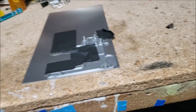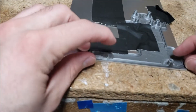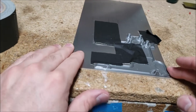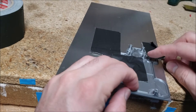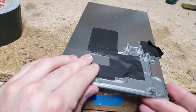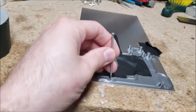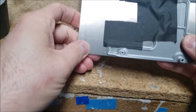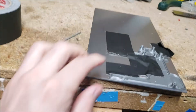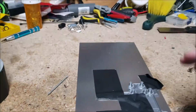Now that we've got that, I'm just going to want to make a little drill guide here. We're just going to drill one of these holes first, and then we can put a bolt through there, and that should keep us pretty steady. Then we'll work on this one. I'm just doing some double checking here. Looks good. This is just a nail — I don't have a drill set, or whatever the heck it's called. Just makes a little divot in the middle, and I'm actually going to drill it. We should start with a small bit, probably. I think I have maybe one set up in the drill already.